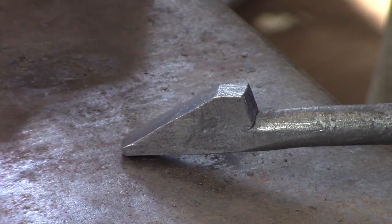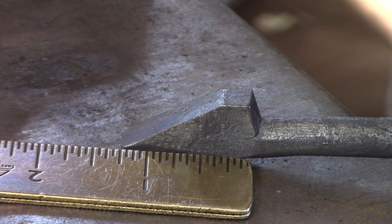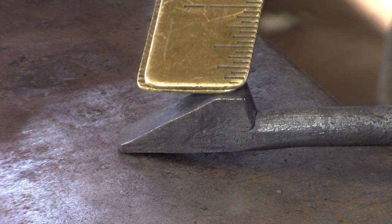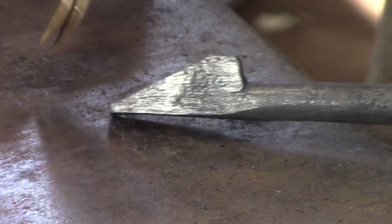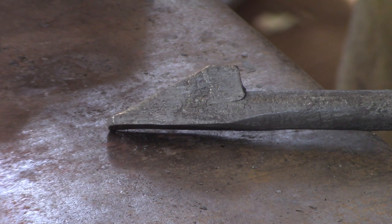Here's my finished barb, which is roughly an inch and a quarter. I've got at least three-eighths of an inch there. I've got a nice flat spot there just as an aesthetic, and it comes down to a blunt taper — let's call that an eighth of an inch on the end.